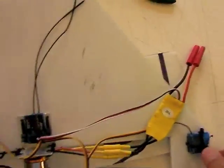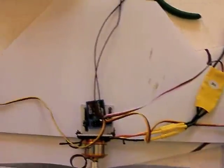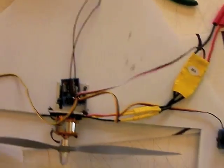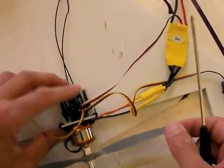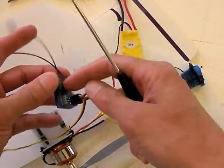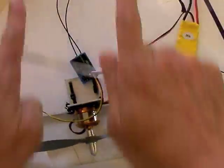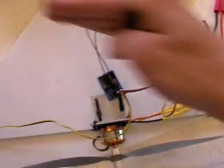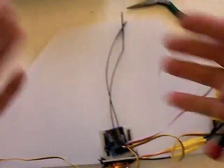So we're now going to zip tie this thing up and secure the components. Step one is we want to secure the receiver, and the way to do it is just a single zip tie right there. We'll keep this thing from moving forward in an accelerated crash. All the forces on crash will be in that direction, or some variation thereof. So we just want to make sure things don't move forward, nor that things can get loose and in flight go backward into the propeller.